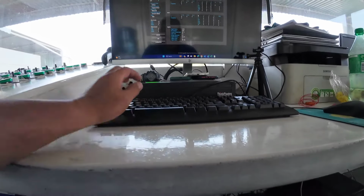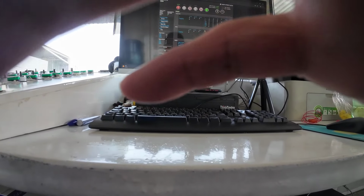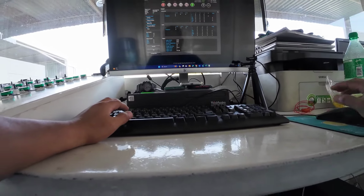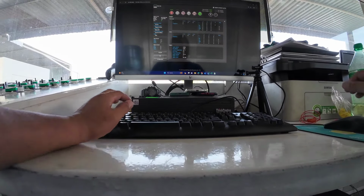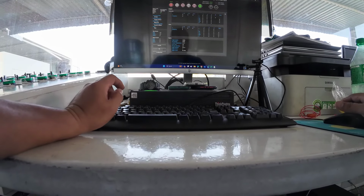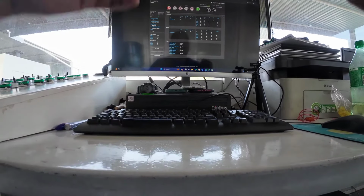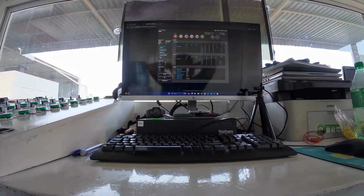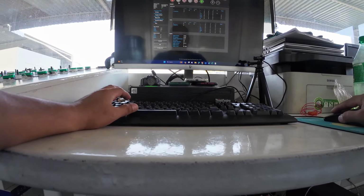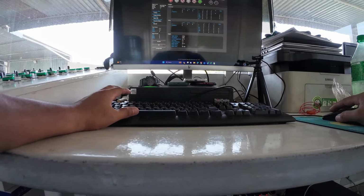So let's start, guys. It's our unfinished work from yesterday. Now I think we are ready, because yesterday we had some issues. They mistakenly installed the incomers for the breaker, which was a wrong connection. That's why we stopped and rewired it yesterday, and after that it was already late, so we had no time to test again. So this morning we're going to test back and put 100% load and double check if any errors appear on the tests. So let's start.